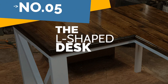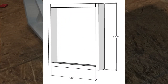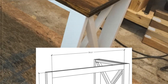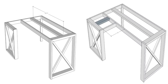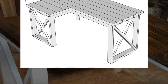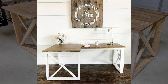Number 5: the L-shaped desk. Construct the leg frames first — build the L-shaped desk's legs by joining vertical and horizontal 2x4s with a Kreg Jig and pocket hole screws. The L-shaped desk should have two legs. Add X-shaped trim: mark your assembled desk side to see where to cut the 1x2 for the X-trim. Join the 1x2 bracing to the 2x4 square with brad nails and wood glue — the first 1x2 must be flush with the 2x4's leading edge. After finishing one L-shaped desk square, continue with the second, then build X-shaped trim for both desk side frames and put together the desk's bottom.